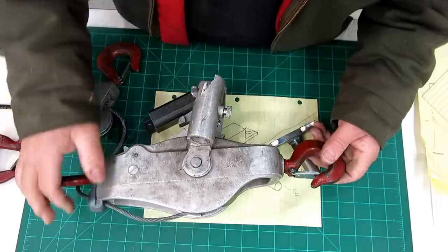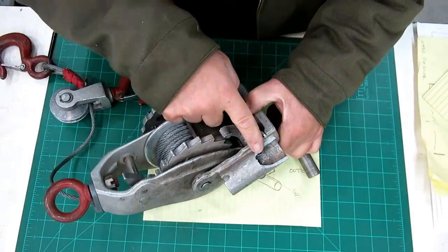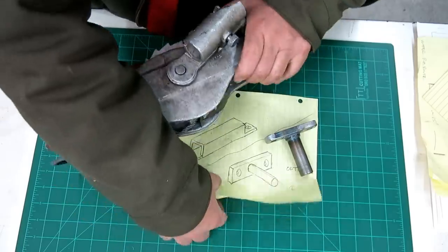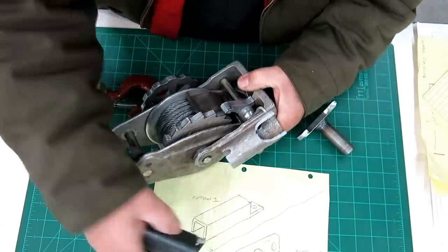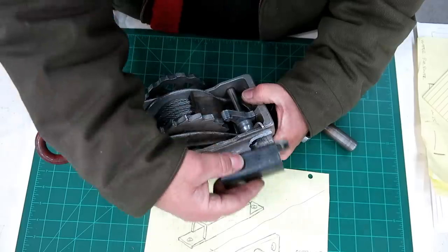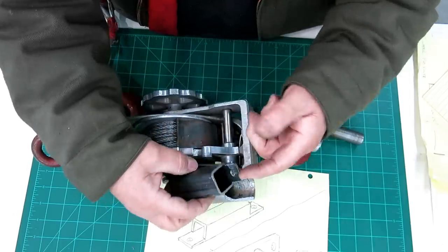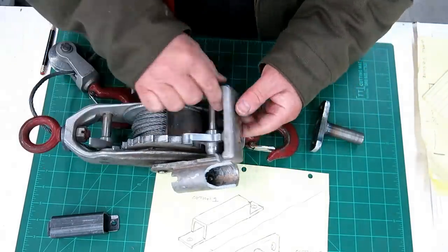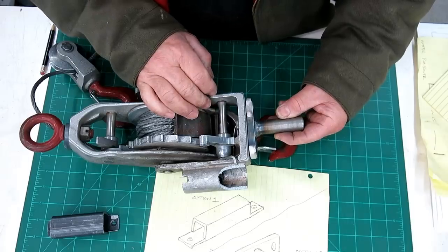Okay, and for the folks that are just coming in to this repair project, Mr. Bozo struck and I broke my come along handle socket. And so the idea with these two methodologies is the first one would be to chop this off, get back flush to this yoke, and then mount this on the yoke like that, okay? And then the handle inserts in here and Bob's your uncle, right? Off you go. The second option is this guy here, and I got a little more meat to work with up here, and that would be to basically just plug this on here like so, okay?